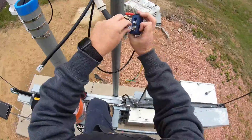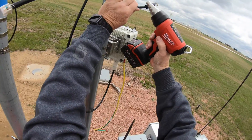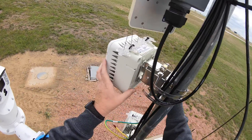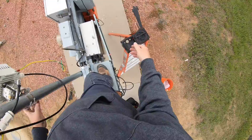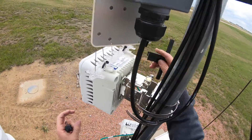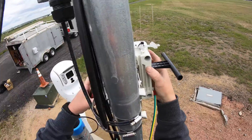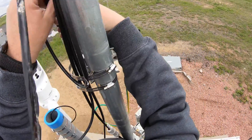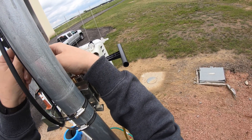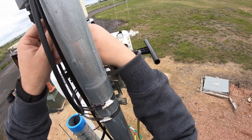We're just rebuilding these connectors with the Sentinel connectors. Going to test this before we get too far along. Put some heat shrink on there with my Milwaukee heat gun - those are a nice little tool, not great for a bunch, but for onesie twosies it really works out handy. Now we're back on track. I got my C-Clew radio mounted and I've got my rough alignment tool out. We'll get it as close as we can, then once we fire the radio up we can use the software to fine tune it. You can look through that little tube and aim it at the far radio just over the black building on the horizon. We've got that dialed in and now we're just tightening things up.